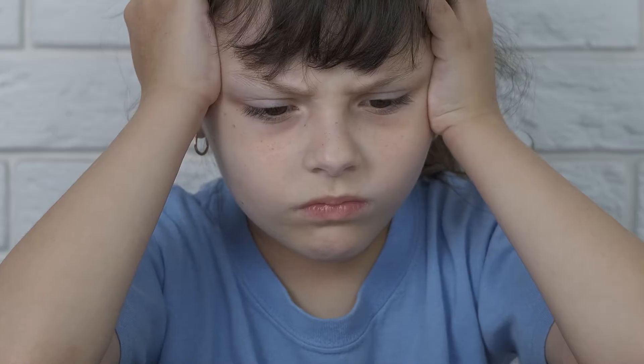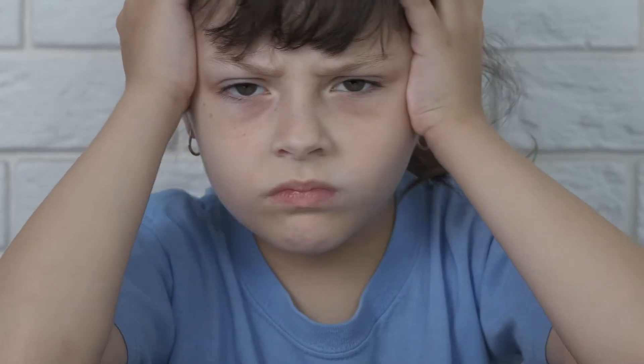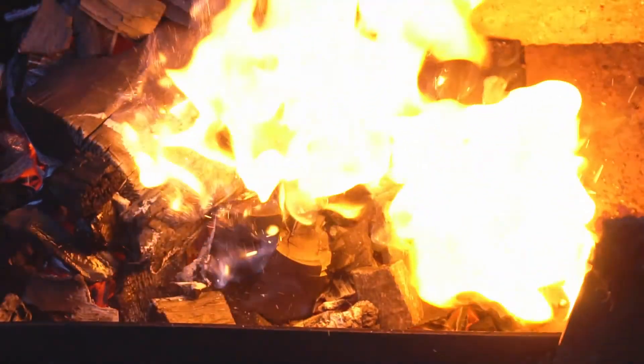You had the nuclear option, but that oven was prone to interference and didn't actually remove the asphalt cement from the aggregate — so there goes doing your gradations. Using an oven and back weighing, which took a long, long time. And throwing it in a can with diesel fuel and lighting it on fire — hey, it did work, and many labs were doing it, unofficially of course. There needed to be a better, safer, and faster alternative to measuring AC content, one that didn't rely on solvents but also cut down on dirty exhaust.